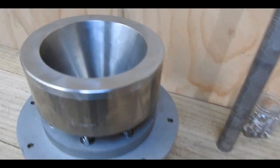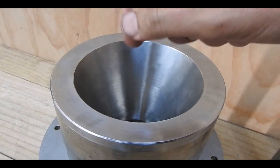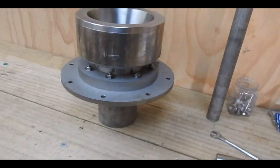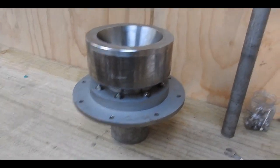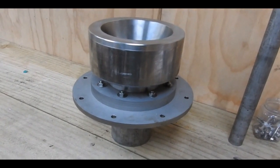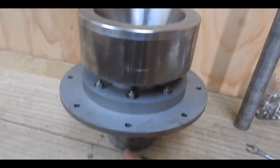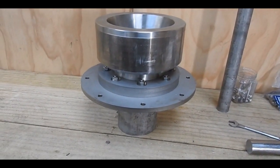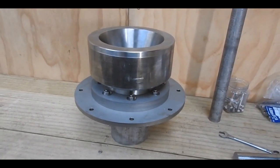What I'm hoping that will do is give me a nozzle that points down like it should, plus also has maybe six radials going out to heat evenly the burn zone. This has a total height of twelve inches from cone to base, which is definitely more than the nine or so inches I used to run. That's a heck of a lot of inches for the wood gas to go through, and I think the benefit will be cleaner and cooler gas coming out from the underside. Charcoal is definitely our friend — biochar is our friend when it comes to ensuring good quality clean gas.